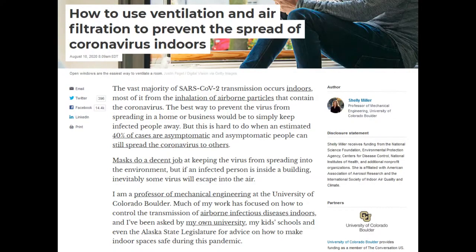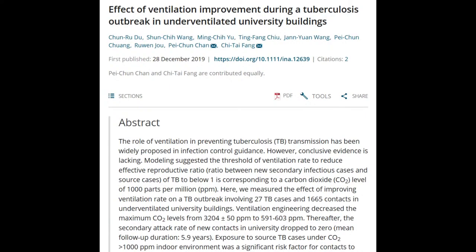It's best to have low CO2, but as long as it's less than 1000 ppm, your body is totally fine with it. Outside is 400 ppm, and as long as you keep indoors at 600 or less — there's a paper on tuberculosis that noted they could stop transmission as long as CO2 was less than 600. Not because CO2 had anything to do with TB, but because low CO2 means enough air movement — air is being evacuated and replaced with fresh air.